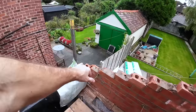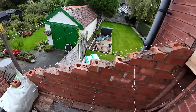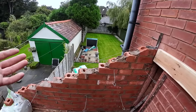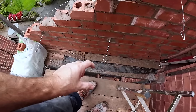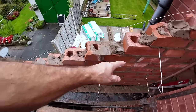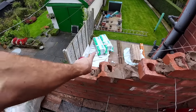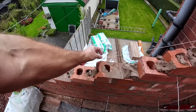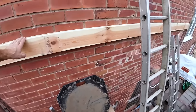And then there'll be a 3x2 there, and at the bottom. Because the 3x2 is just perfect for going through the horizontal ladder, fascia ladder, spar ladder. I don't know what they're called, but it's basically you've got a spar against the inside of the skin, spar in the cavity, and the ladder's coming off the spar. So you have four pieces of 3x2 sticking out, and then cut off flush or slightly back for an air gap. And then the fascia board attached to that. So that's all fixed in.